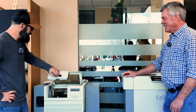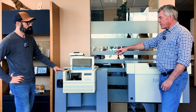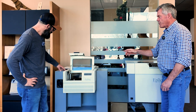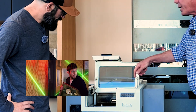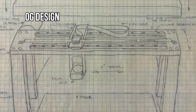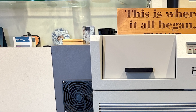It's an RF tube — specifically a Synrad tube that's mounted in the leg. It's a long skinny tube, vertically mounted in the leg. It hits a mirror over here, then it hits another mirror here and goes down and engraves. The carriage moves back in the X direction and the table moves in the Y.